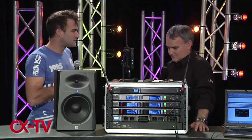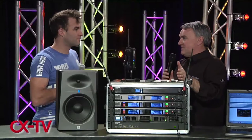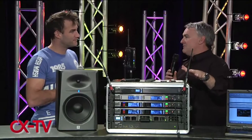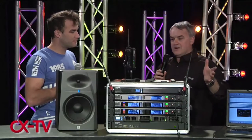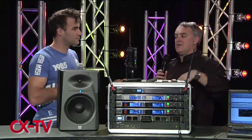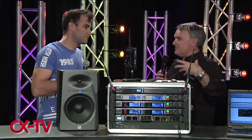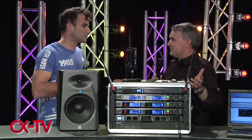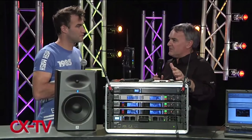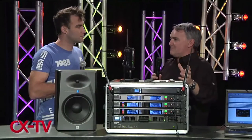The biggest problem we all face today is the growing number of wireless mic systems. Not that many years ago, 16 mics on a show was considered big — now that's an average church. We're up around 40 to 50 systems on the largest shows, sometimes more. On top of that, available frequencies are shrinking due to digital dividend sell-offs around the world, so the pool of available frequencies is getting less while demand is getting greater. There's a lot more competition from white space devices, television transmitters, other wireless mic users, intercoms, and in-ear monitors. On the largest shows it's not uncommon to have a dedicated RF coordinator.